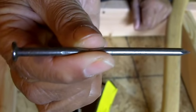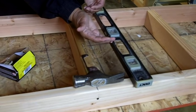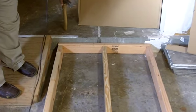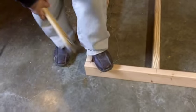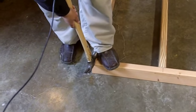What you're going to need is a 16 penny nail — you're going to want this for framing. Don't forget your eye protection, have a good hammer handy and a level. There may be a temptation to use a shorter level like a torpedo level, but when it comes to framing, the longer the level the better and more accurate the read. I've got my bottom plate braced up against a wall, and you want to stand on the wood — stand on your top plate and on the stud — to keep everything nice and square.